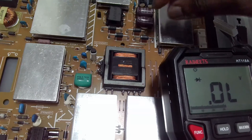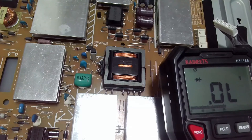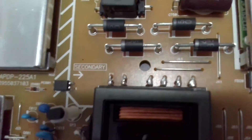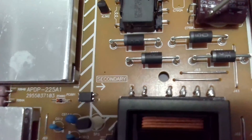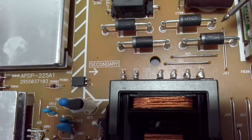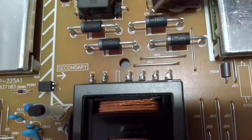For diodes you can't always be concrete — sometimes you can get a false reading, so you may have to pull it out of circuit completely and then test it outside. When I look very closely, I'm not sure if it'll be visible on camera, but these two here look kind of shiny compared to the other one. The copper wires look a bit more shiny on these two.